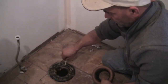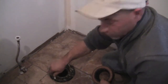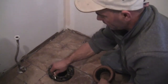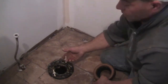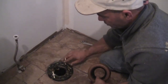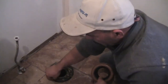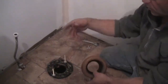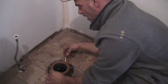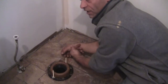Okay, bolts — put them in like that. I always use new bolts; you don't want to try to use the old bolts over again. Plus, the new bolts are going to be longer, and you're going to see how much easier it's going to make things. There's a little plastic washer that comes with them — just push them right down like that. They're going to help hold the bolts straight and keep them in there while we put our toilet. Our Johnny ring is going to lay right like that. Make sure the bolts are going at 9 o'clock and 3 o'clock — that'll make things a lot easier.